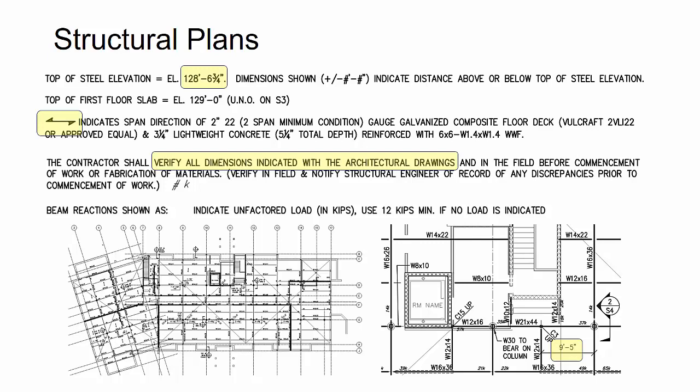And I'll locate things there, but I'll put those on hold, or I'll add an extra 12 inches or something like that to the material length for an advanced bill, and I'll tell the fabricator that as a note. But then I'll also ask the fabricator whether or not we should say approve or please provide, or verify the dimensions out for approval. And I'll also ask them, do you want me to write RFIs locating these beams?